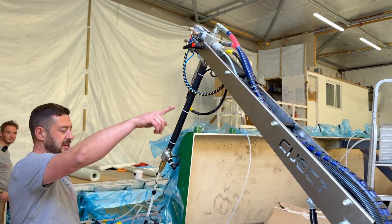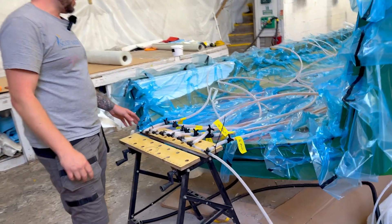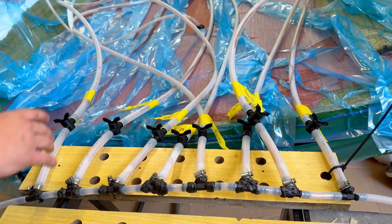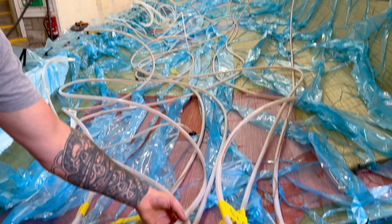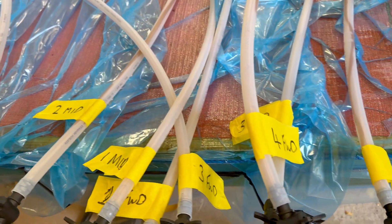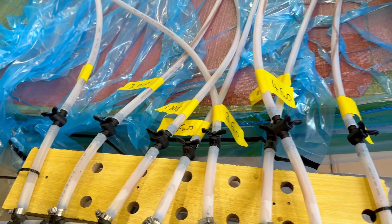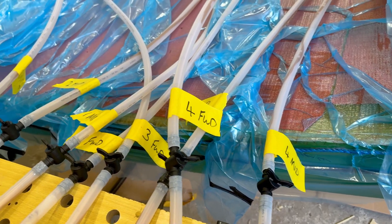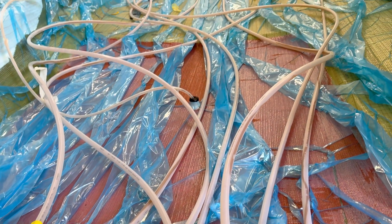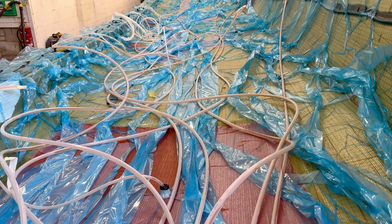The resin and catalyst are mixed at the head, then come down through the pipework into a homemade manifold, which feeds all the resin castles. This directs the resin to where we want it — we've got one mid, two mid, and forward positions. We know exactly which taps to open so there's no confusion. It's absolutely critical that we open the right taps at the right time to prevent air locks, because if an air lock forms and the resin goes around it, there's nowhere for the air to go. So having everything clearly labelled is absolutely important.